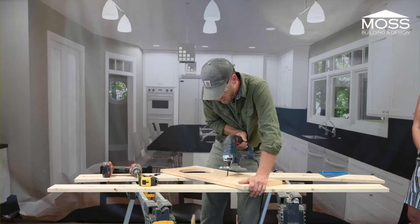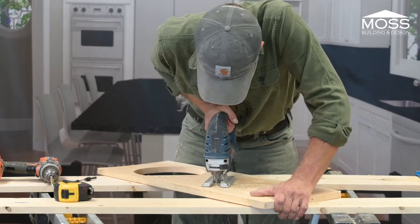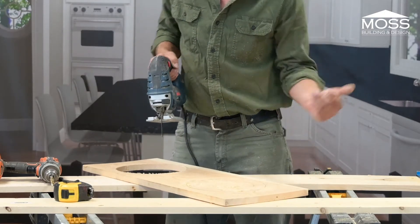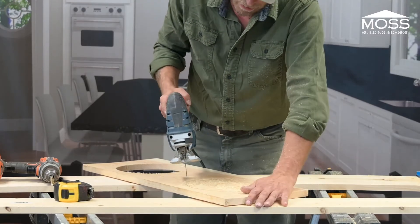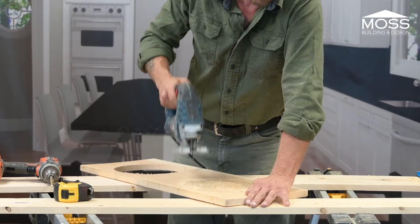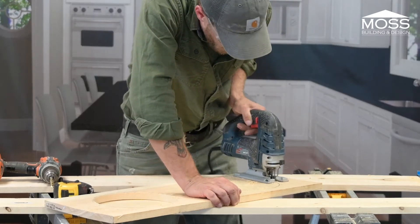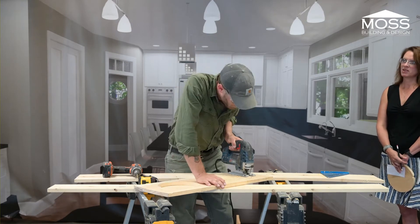It's like winter candy in here with all this pine flying around. Pine is probably a good building material — it's cheap and doesn't warp too badly. It's not really dense, which is a variable. If we're working with maple, like when we were setting cabinets today made out of maple, it burns up drill bits because it's really dense. Pine is called a softwood. For cabinetry you want something more sturdy — a lot of face frames are made out of maple because it's one of the hardwoods and it won't dent as easily.